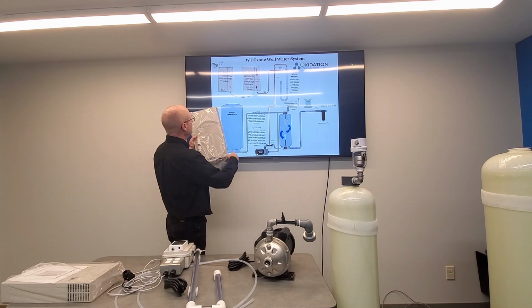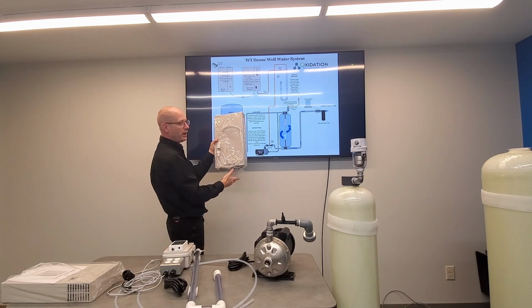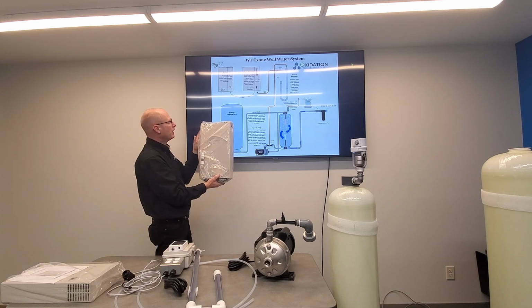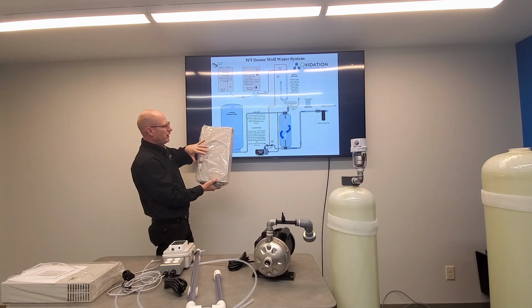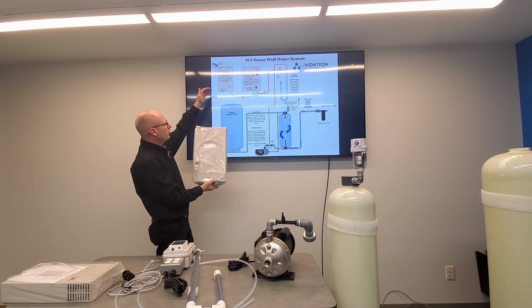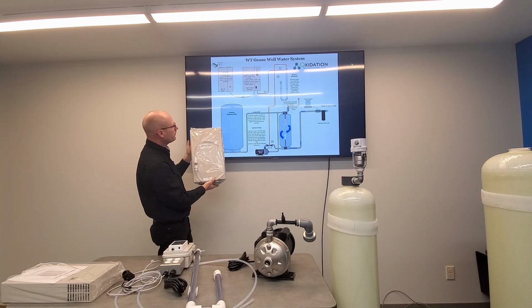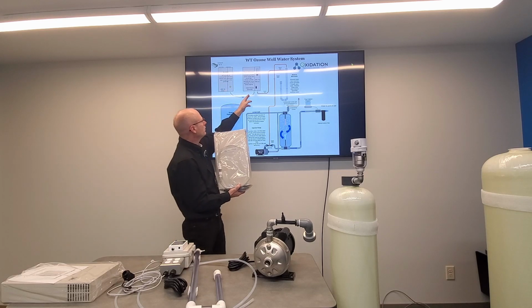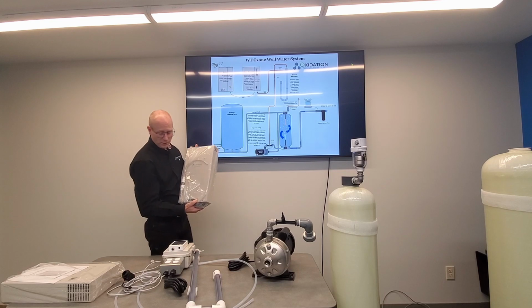The other component is the air dryer. And there's a dry air indicator in here. That's pink when your air is not fully dry. It turns blue. After this is running for a time, it may take a few hours. Basically, it's heating up desiccant. And when your system pulls air into the machine through the desiccant dryer, the dry air flowing through will turn that blue. The ozone dry air gets pulled through, adds ozone, the ozone gets injected into your system.